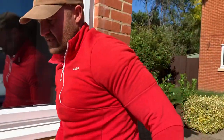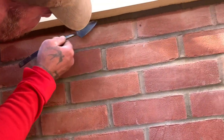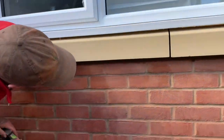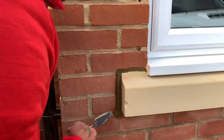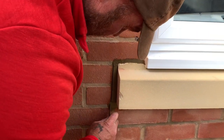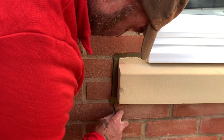Go a closer look — come down here. Just gives it, once we get a brush on that, get rid of this excess — gives it a nice neat finish. And then if you come round here, I'll do the horn the same. Gives a little cut there, get that in, so the other joint blends in.